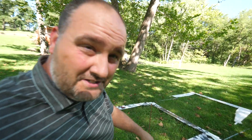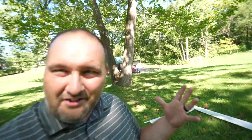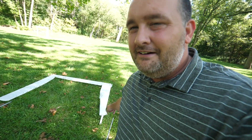The bottom half of my double gate is made out of EMT — two full sticks for the sides, each 10 feet long. You've got the gate, my 3D printed T-connector, and then it extends up another four feet above the gate on both sides. Then I have a seven-foot section — you cut that to length — it runs across there. So you have a completely EMT bottom half. I had made a double gate out of all EMT earlier this year with couplers on the ends to make it extra tall, and those gates stood fine.